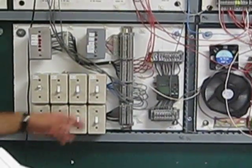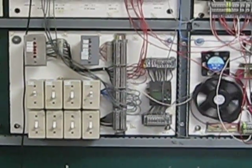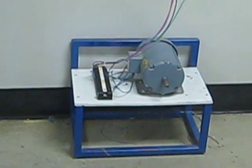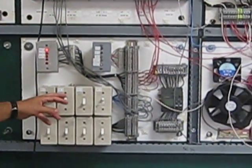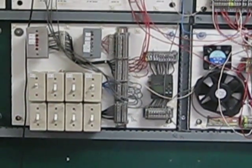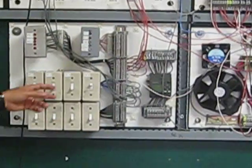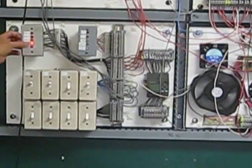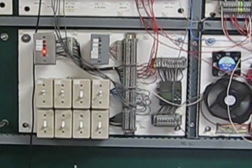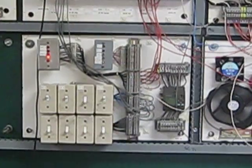Let me turn my pressure switch off — the system is off. I'm going to put the system in auto and check the status of my control switches. Turning the pressure switch on: pump number one is on. When the pressure switch is turned off and I come back, pump number two should come on. And you can see the light over here indicating pump number two is on — coming from auto. The control relay is off in this state.